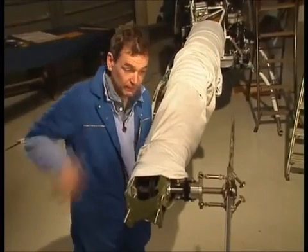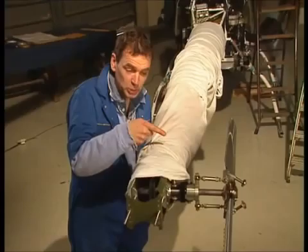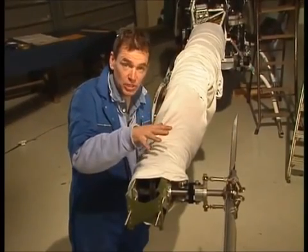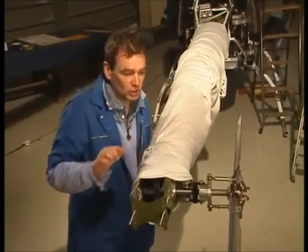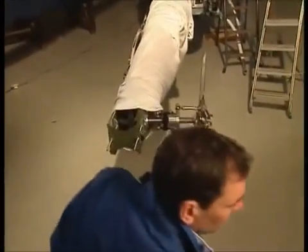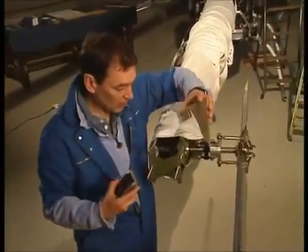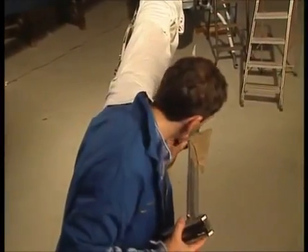Pilot seat. Very nice. Now, maximum right pedal. There you go. And by altering that pitch angle, you alter which way the tail moves. Now, the angles are critical again. So, what we have is a special little block with its little aerofoil shape cut out in there, which will slot over the blade, like so, between rivets.